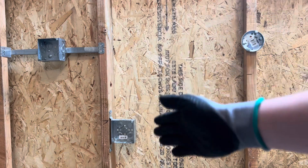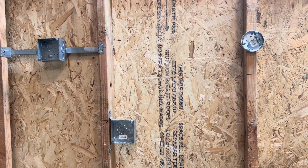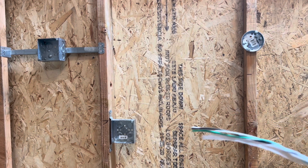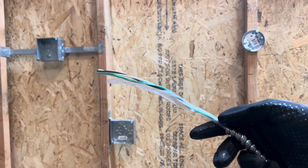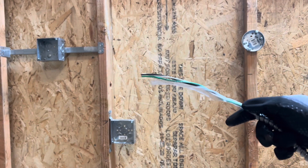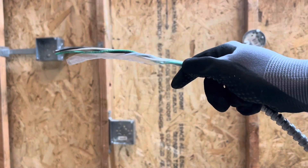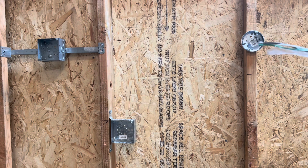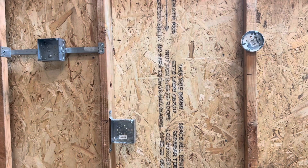So right here I got my four square box, and I have some other future boxes here for some lighting. I'll probably do a three-way switch or a four-way switch eventually. Right now I'm just going to install one piece of MC wire with an MC connector. If you go back in the videos, you've already seen how to strip the MC wire, how to put on an anti-short, and how to put on an MC connector — so I'm not going to go over any of that today.